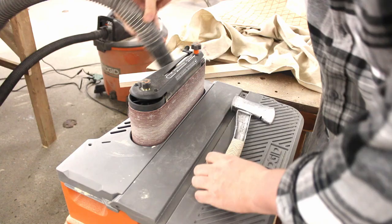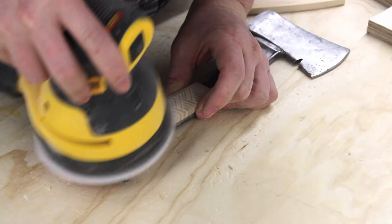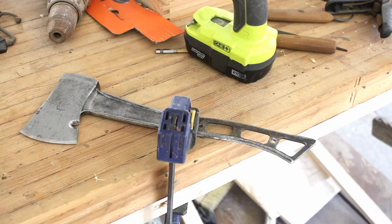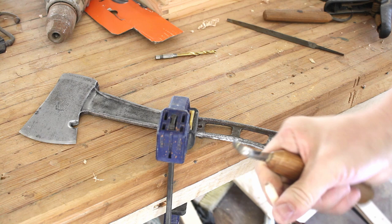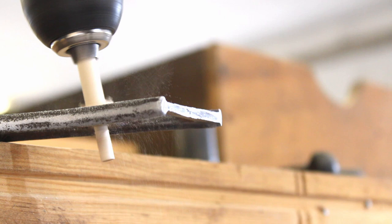Clean up your spot because it's time to move. After the rough shaping on the oscillating belt sander, taking it 80, 120, 220 to 400 grit on the random orbit sander. And here's a cool little trick: sharpen the front of a dowel, chuck it up into your drill — if you've got a hole in a piece of metal that you need to make a dowel for because it's an off-size you don't have — spin it, a little bit of pressure, and you've got a dowel exactly the right size for that hole.